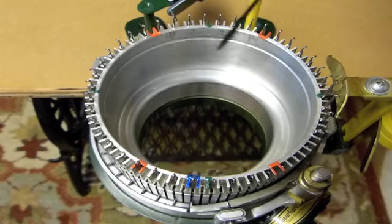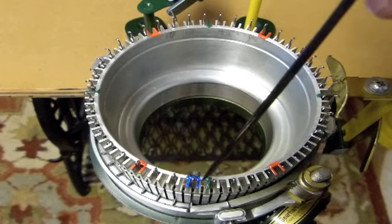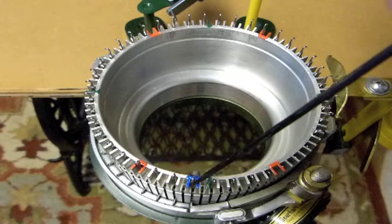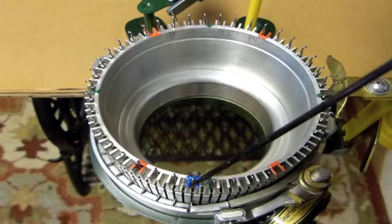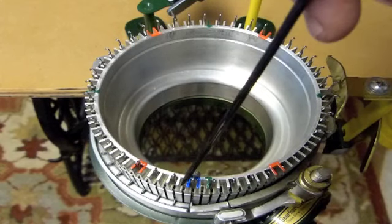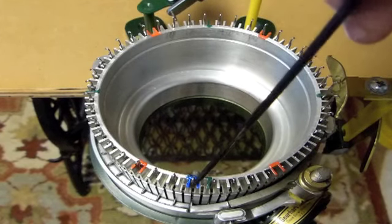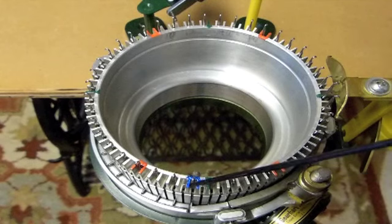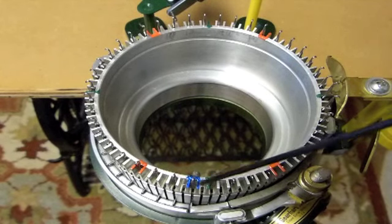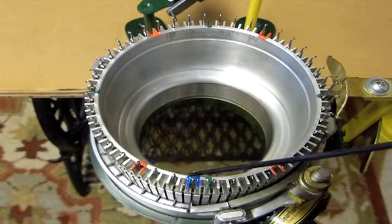Mounting the cylinder pin at the front leaves that back space open, free of the cylinder pin, so I can mount my heel forks without interference. The reason I marked the cylinder pin slot in blue is because there always needs to be a cylinder needle in that slot — never a ribber needle. You can have a ribber needle to the left or right of the cylinder pin, but never right above it. If you were to put a ribber needle there, your yarn could potentially be caught between the ribber needle and the bottom of the ribber dial because of the pin being there.